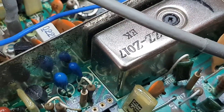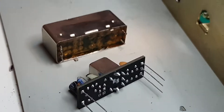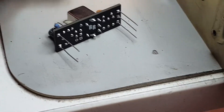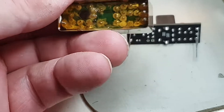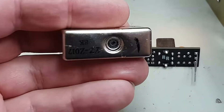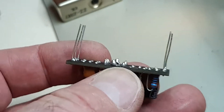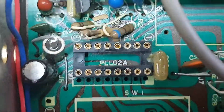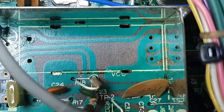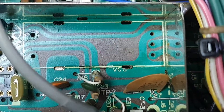The next stage is to pull the VCO out and desolder it from the other side. The VCO is out — it's the old steel-can one, Cybernet Mark One. In preparation for the new one, we line up all the pins equally spaced apart, insert it from the top, slightly bend the pins to hold it in place, and then solder from the other side.